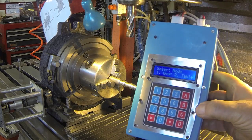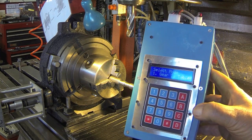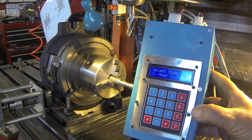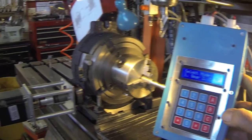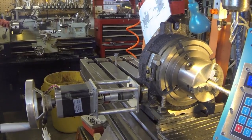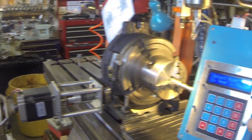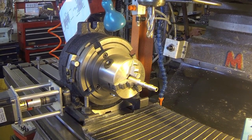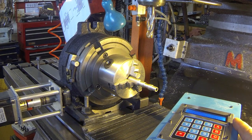The controller — everything's inside. It's got an external 24-volt supply that supplies the power to the stepper, and you can see the stepper there. What I'm doing here is I'm setting up to do the camshaft, and we're pretty well there. What I wanted to use the controller for is so I can set it up where I move this exactly one degree.